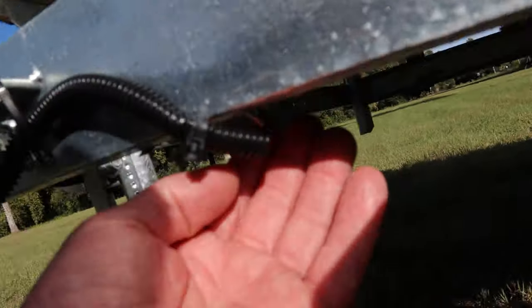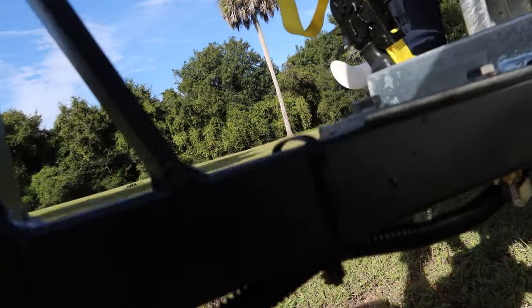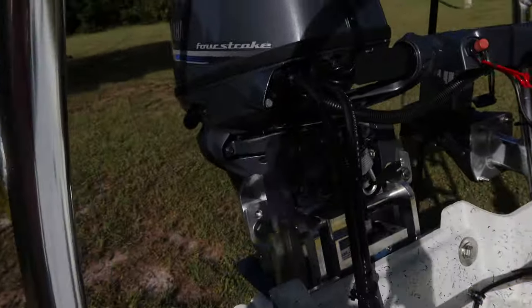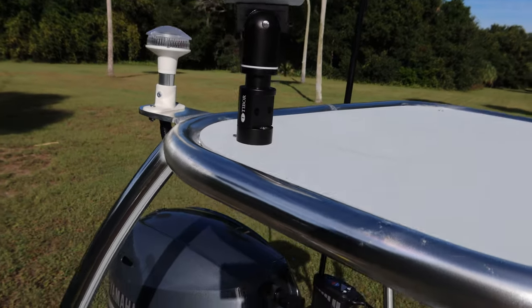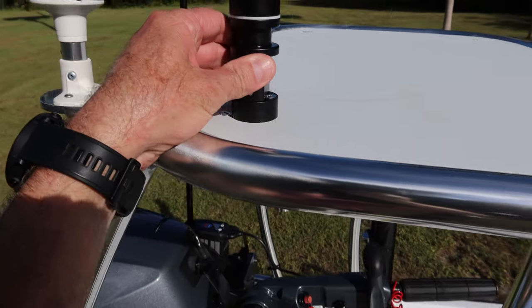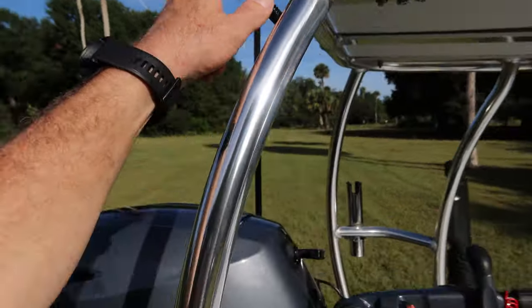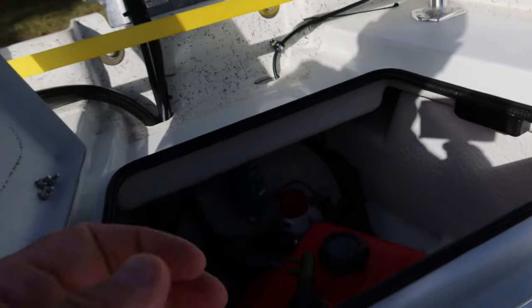We've wired everything really nice with tube wiring. We've heat shrink, butt connected, heat shrink, then put heat shrink tube over that. We got a nice T-Bone removable quick release push-pull holder. We got a high-end Perko LED stern light. Had a nice hatch put in. We installed a water fuel separator. If I can get down there and see that thing.